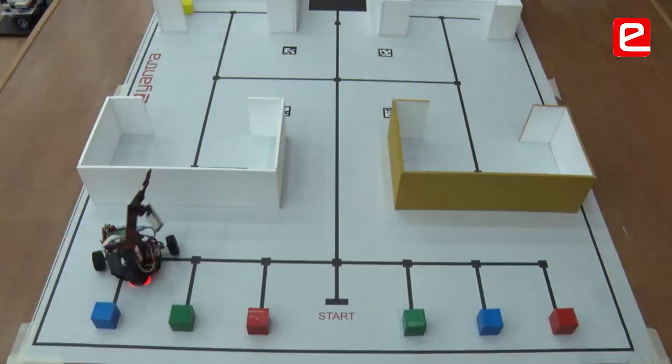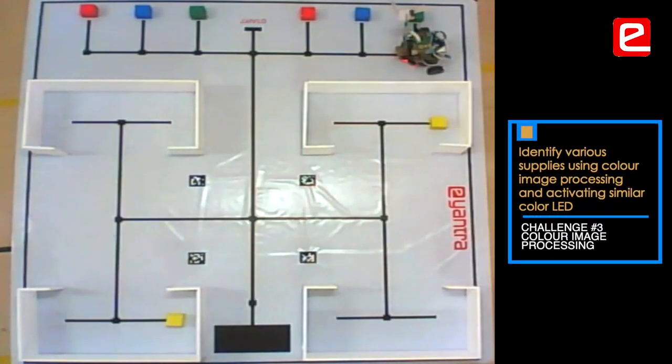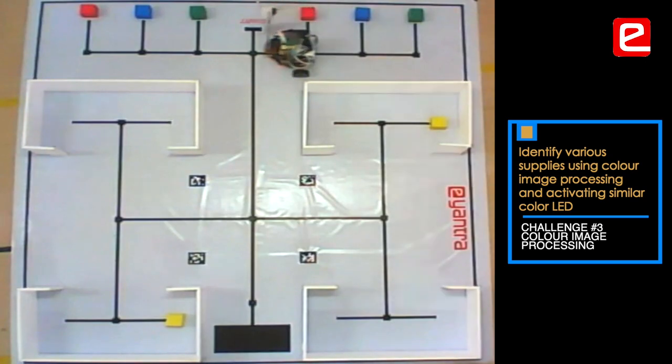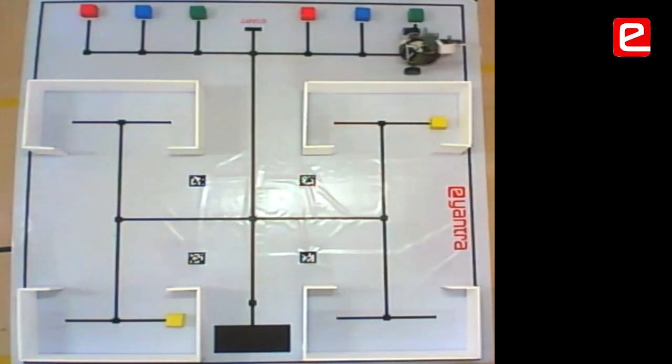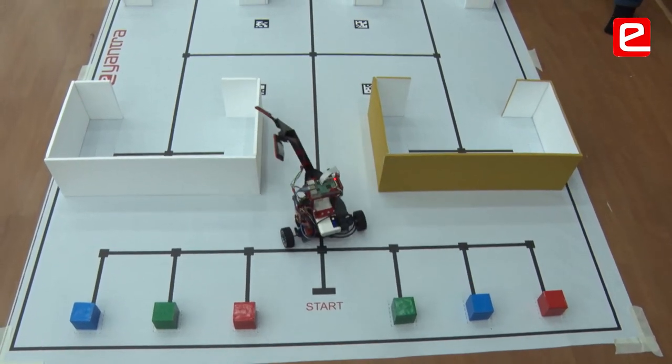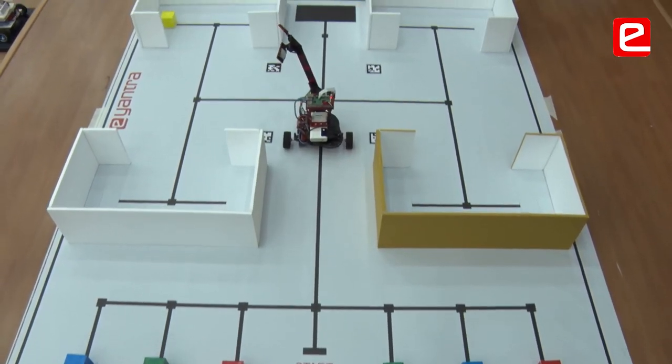In the kit we were given two types of servos — one with less torque and one with larger torque so you can lift heavier loads. The data sheet says that even at no-load condition it draws around 2 amperes of current. Initially, we blindly followed that and built a circuit supplying 2 amperes, not adding any other servos to that power circuit. We got a power shortage, so we tested the actual current draw — it was just around 200 milliamperes. There's a large difference between the theoretical value of 2 amperes and the practical value of 200 milliamperes.